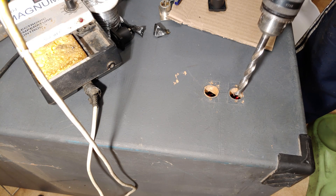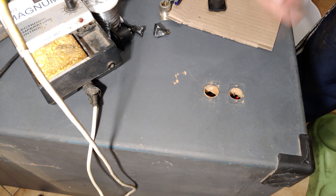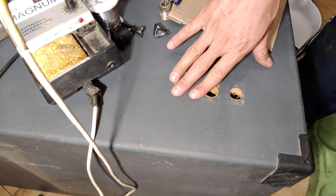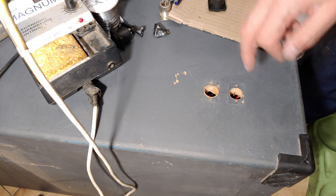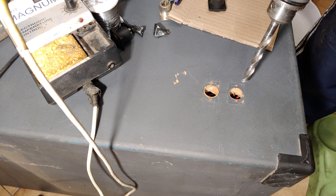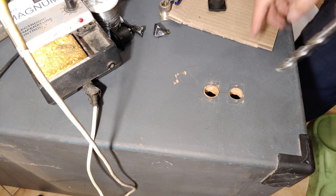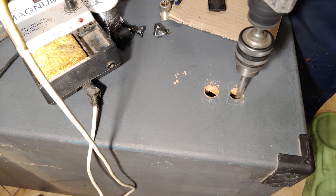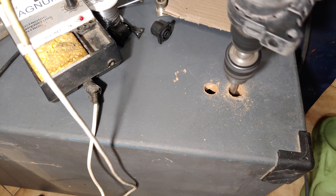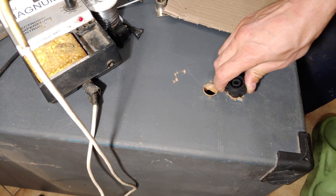Be aware that when you're drilling, the filings are going to go inside. If they're going to fall on the woofer, take your woofers out. Mine are not in this area and this is a ported box, so when I put it upside down the filings will just fall out. Ideally try to do this without filings going into the box — you could lean the box at an angle and let gravity push the filings to one section. I can see my lines there, so I'm just going to drill them bigger. My advice is to keep checking every now and then — you don't want to oversize the hole.